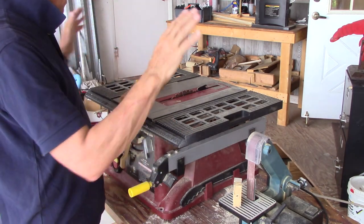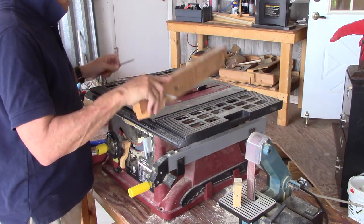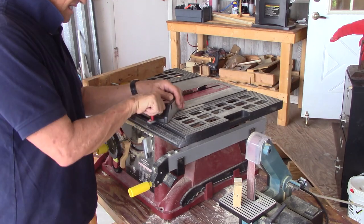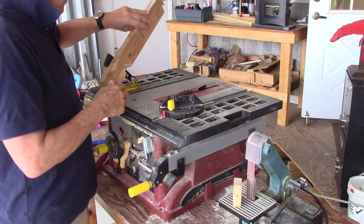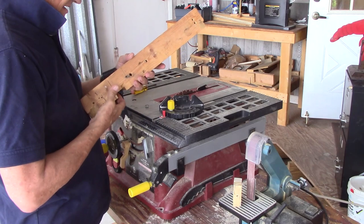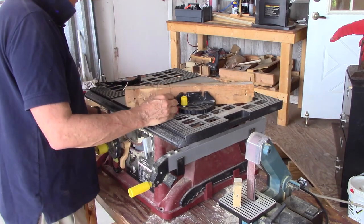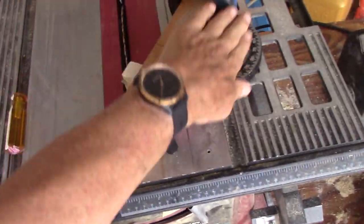Key point of this whole video — you've got to take it out. It's a pain. I'm taking the miter gauge to the other side, tuning it to the other 35 degrees. Now you have to get all this stuff over — this has to go to the other side. You have to re-center everything. Here's the new blank, the opposite blank. Change the miter gauge to the other side of the blade.